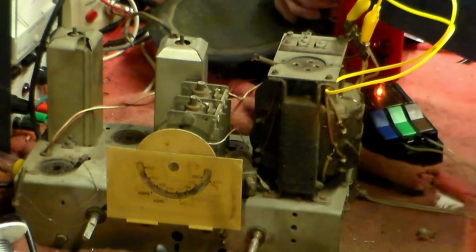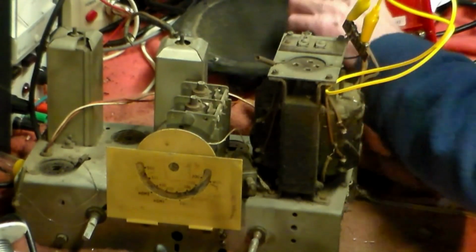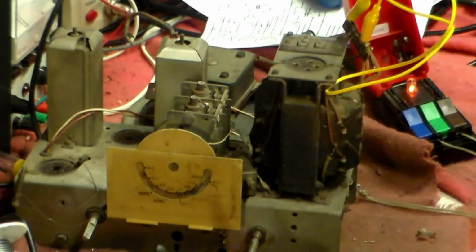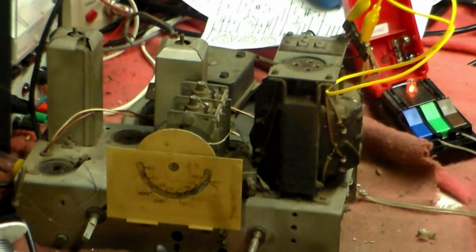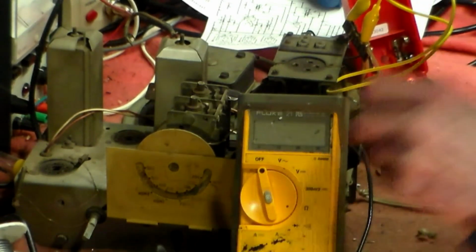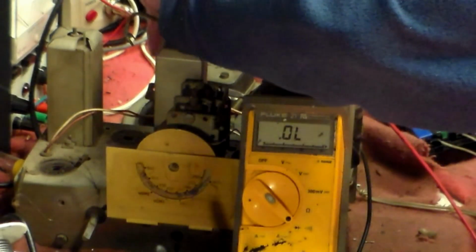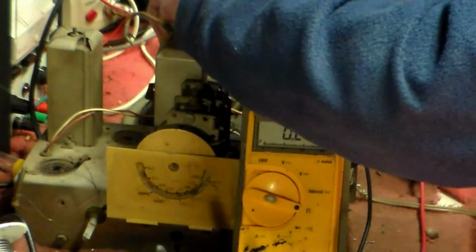Another thing we'll check, although it's easy to replace, is the output transformer, which is here. Turn the speaker over like that and go between these two pins here. So I'll put the crocodile clip back on here. Like that. Let it onto there. That goes up like that again. Goes to ohms, of course, and we'll see what we get. Okay, I'll go to ohms instead.